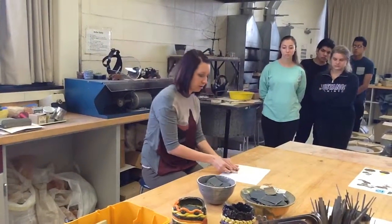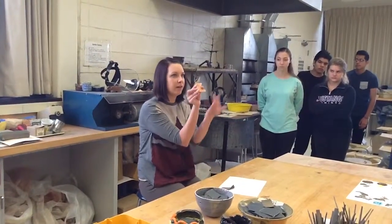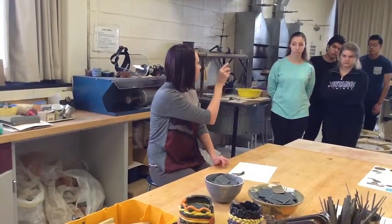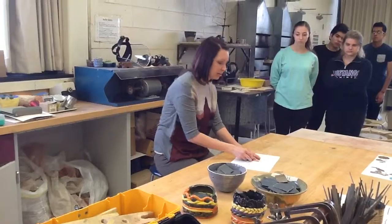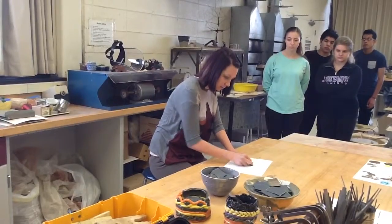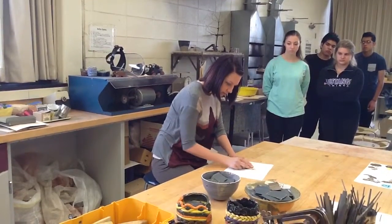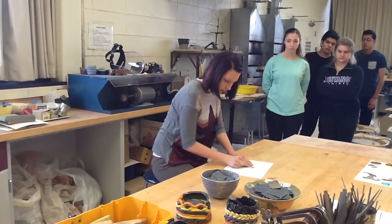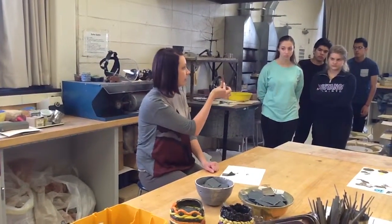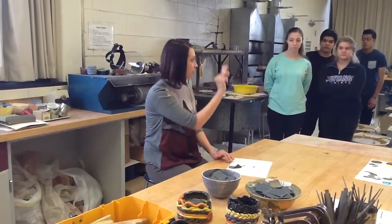If you move your sandpaper all over the place, you're going to get markings that are all over the place. They're not uniform. It's going to actually scratch up your metal more than help it. So make sure when you sand, you're sanding just back and forth in one direction. And you'll start to see the metal get a lot shinier and a lot cleaner just by using the 100. So you'll sand both sides of your metal with the 100.